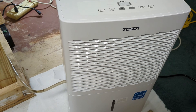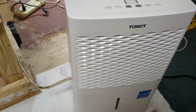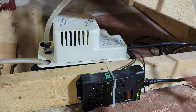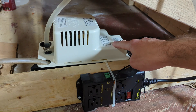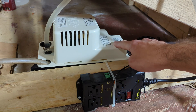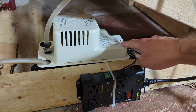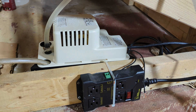Today I got a request from a watcher. They need the step-by-step setup for setting up a dehumidifier condensate pump with the relay. Water from the dehumidifier enters the condensate pump. The condensate pump pumps the water up out of your basement, but in case the pump breaks, there's a safety overflow switch that's going to detect the higher water level before water spills out onto the floor. And that switch we're going to hook up to a relay, which will power off the dehumidifier.